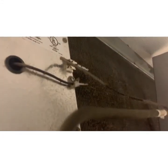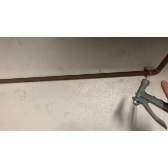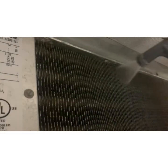This is the cooler, and this should go without saying, but you can't bring the hose into the freezer with disregard because it's a freezer. But there is a tray here. I'm king. Boo. There it is. I could edit this stuff out, but what fun would that be? This is real life. So there's a drain pan here, goes into there. Adios. So as long as you spray slowly, even in a freezer when you have to defrost the coil, you can do that. Nice and gentle.